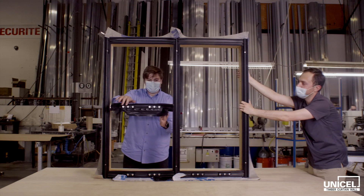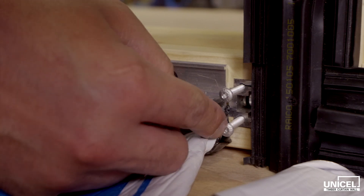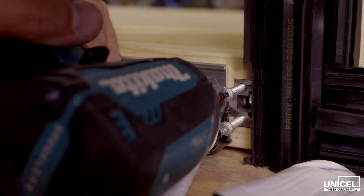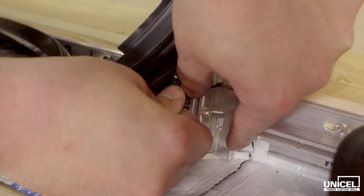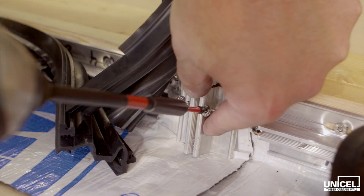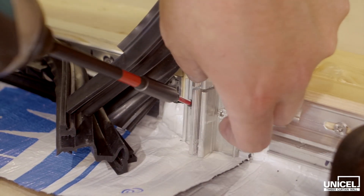Press the transom until the connector stops are engaged. Insert the special nail screws up to the thread using grease or a small amount of soapy water as needed to help with the insertion. Tighten the special nail screw. All vertical and horizontal mullions around the perimeter arrive at the job site with a membrane already pre-installed on them at the factory.